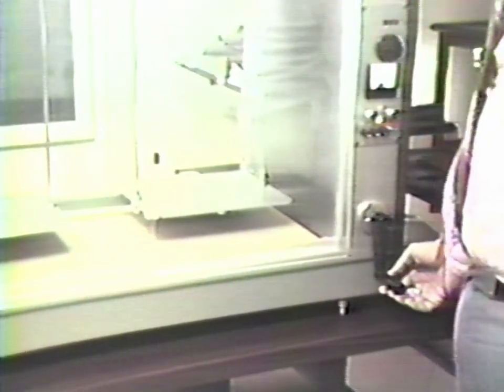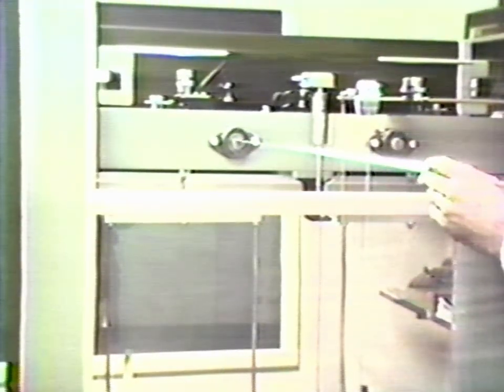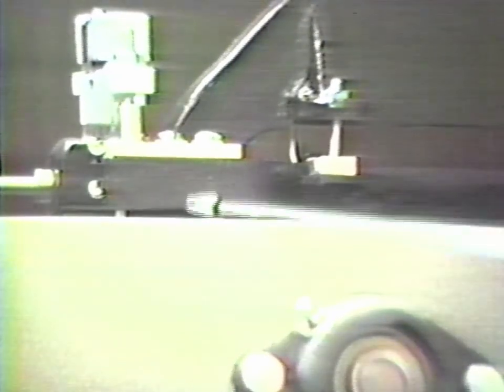The arrestment consists of a lever which, through two drive chains, operates two camshafts. These camshafts operate in ball bearings and contain within the framework eccentric ball bearings which operate against the arrestment arms. As the handle is rotated, the arms are raised and lowered a very small amount. This amount is just sufficient for the beam to travel properly in the photodetector.